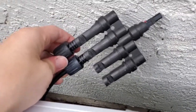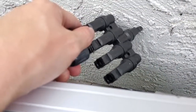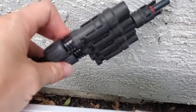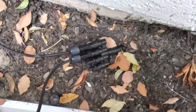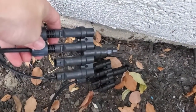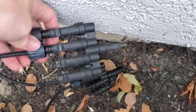I'm going to take the leads from all four panels and plug them in here. Because it uses male and female connectors, you can't get the polarity wrong — it won't fit if you're putting the wrong one in. I'll put all the leads from the four panels into one connector and the other set of leads into the other, and I'll end up with two leads coming out from those four panels, all connected up in parallel. That's how you use the four-piece MC4 connectors to wire panels up in parallel.